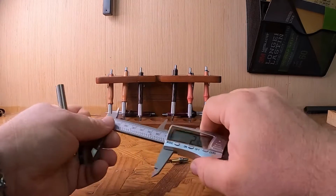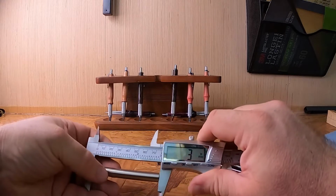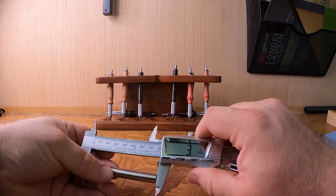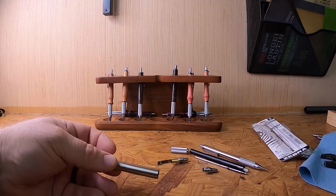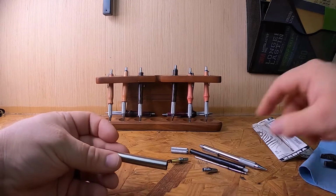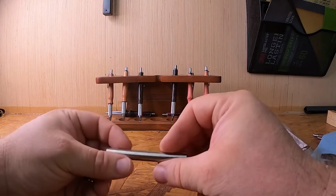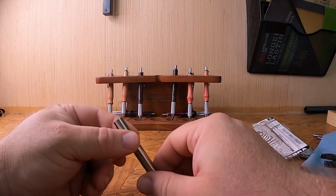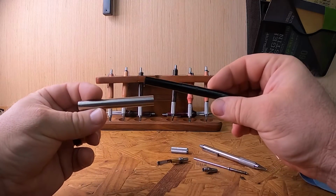And of course the overall length is right at 3 inches. And you would treat it like a normal pen blank from this point out. Rough out the exterior surface so that your glue can have a good adhesion with a wood blank or whatever material you're using, and putting it back together is just a reverse of what you did.